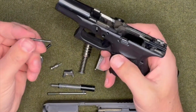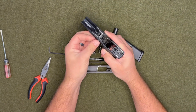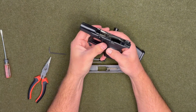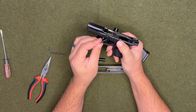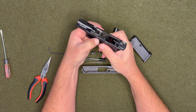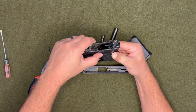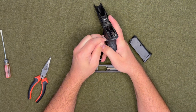What I usually do is put the top pin in first so it'll align with everything and make things a little easier. Get this pin in there — sometimes the slide release will get in the way so you kind of want to maneuver that hole — and then that'll just fit right back in there. The last pin will go right back here. Kind of force that sucker in there and level it out.